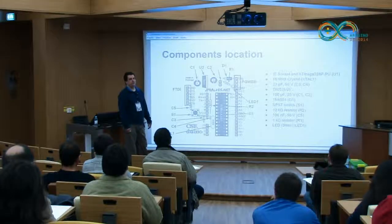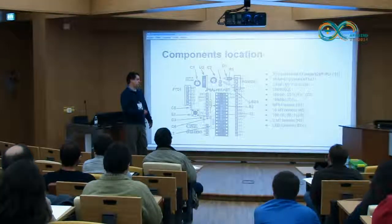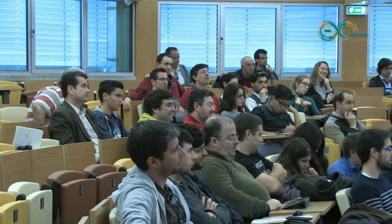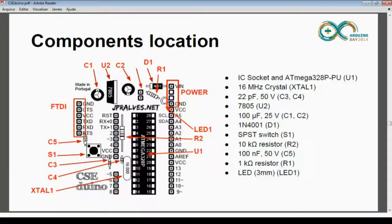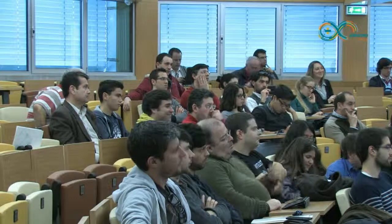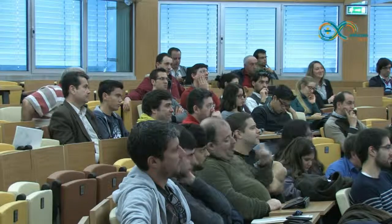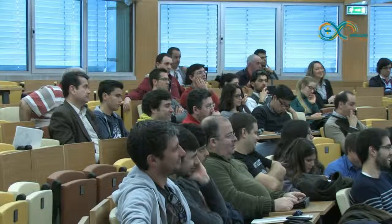What I've learned from my experiments in electronics is that although it's a science, it's not an exact science. So you can put a different value. The thing that is very important is the voltage rating. The voltage rating should be higher than the voltage that you are putting in, because otherwise the capacitor will blow. These capacitors also have a very interesting feature: if you connect them the other way around, they will blow. So take care.